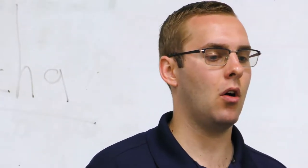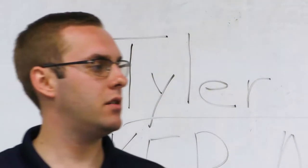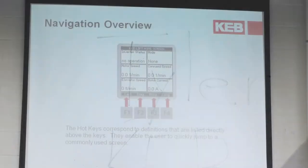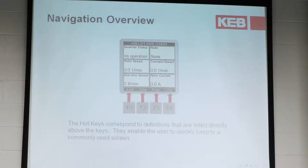It says 'Operator is not synchronized.' Okay, so this is the synchronization procedure — the keypad and the control card haven't been synchronized, so we need to synchronize it. It should walk you through what to do on the screen — it should say press Enter to proceed. So if we all press Enter now, it's basically saying we're still not synchronized — I've got different parameter values than what's in the drive. It should say press Enter to proceed again.